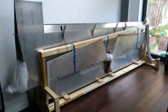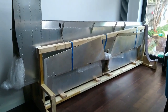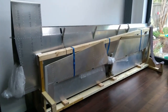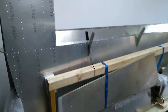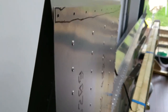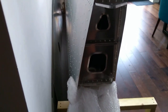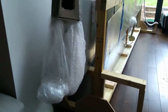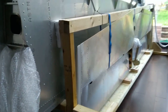The big news is that the right wing is now completed, almost. There are a few bits to be done. As you can see on this image, on that trailing edge where you step onto the wing, I haven't finished that last row — I'll need to align the flaps and the ailerons before finishing that, just to check that the alignment is correct, then I'll rivet that. The inspector had been around and signed off the frame of the wing before the top rivets went on, so on his next visit he should be able to sign off the full wing.